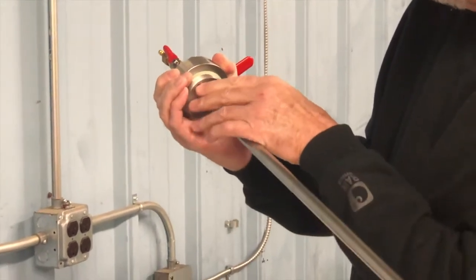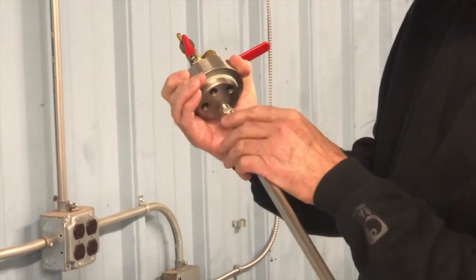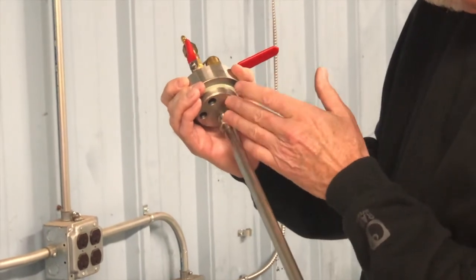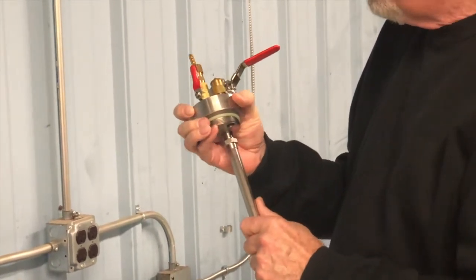You can see on the bottom there are three separate orifices. There's a spare that's just got a plug in it, then the nitrogen feed orifice, and then the safety relief over-pressure 10 psi pressure relief valve.